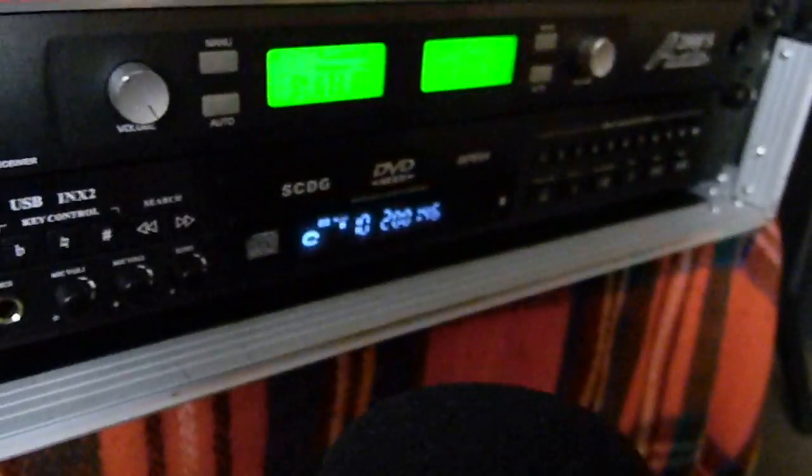And then I'm going to bring out the handheld real quick. This is the handheld I was just talking about earlier. When you power this on, you have to hold it in basically until it lights up. Now it's going to be a little hard to see it on the video because of the actual light on the screen. It shows the channel. So let's say I change that channel and then I want it to change this. I would hold the button down and then it would start blinking, and then I change it and then press this again. It's also in the manual. It will show you how to do that as well.